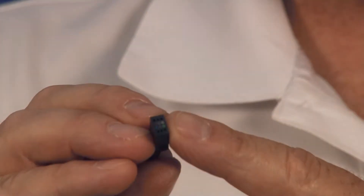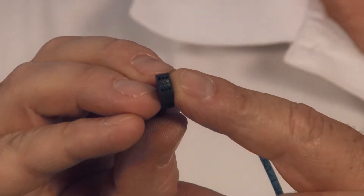One option is to purchase a fan out kit. A fan out kit is a simple device that has a bunch of little tubes where you feed your 250 micron fiber in, and you basically create a 900 micron fiber out of it. These fan out kits come in four, six, and twelve fiber versions and they fit like a glove over the distribution style SSF fiber, bulking it up to 900 micron so you can then terminate it. There's also a breakout kit version that does a three millimeter jacket instead, for breaking out fiber. But the fan out ones for 900 micron are the most commonly used.